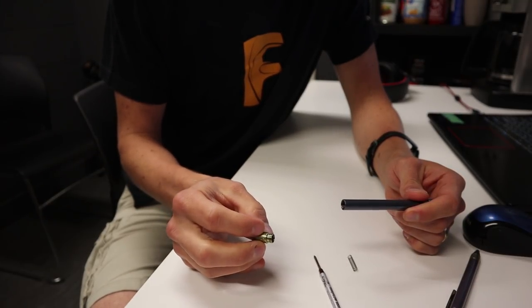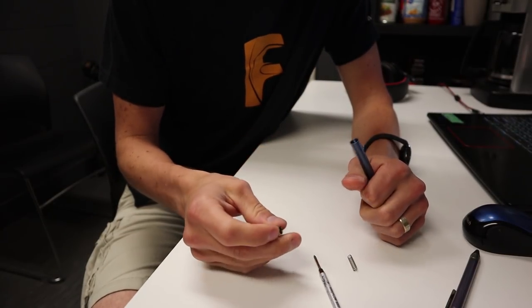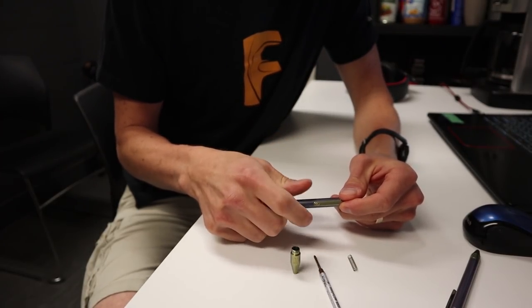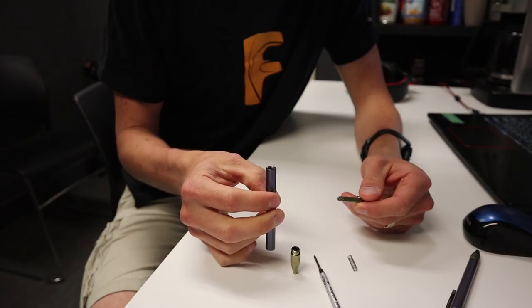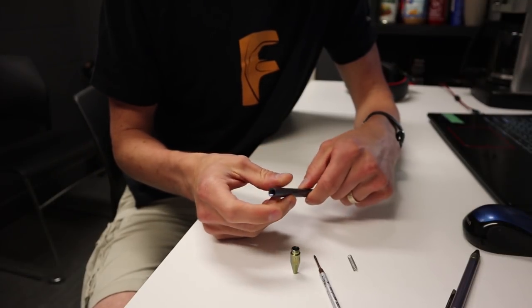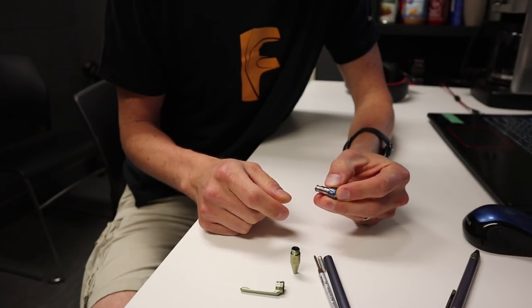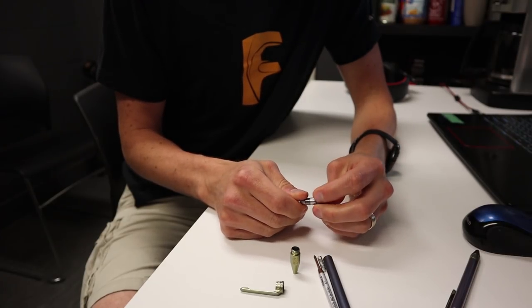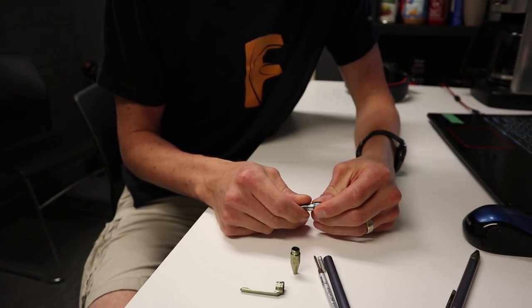So the tip comes off nice and threaded. As we go to make the next batch we're going to be doing quite a lot of changes — just super minor stuff, like that inside chamfer needs a bit of a change. I think the tubes are pretty good. We're using tubing for this, but eventually as we get into other materials like brass and copper that you probably can't buy tubing for, we'll have to drill through and get really good tolerances that way. The clicky mechanism does not come apart very easily, and that's kind of by design — there's a lot going on inside, and if you open it up you're pretty much bound to lose one of the three ball bearings.